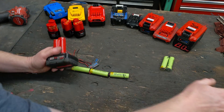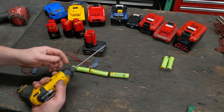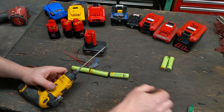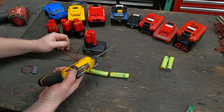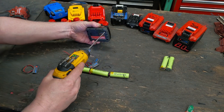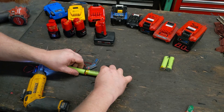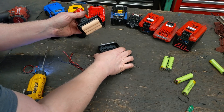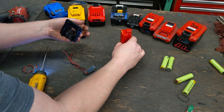All we have to do is take this apart and start wiring it up. We do need one thing — almost all these battery packs use a Torx screw. This one's a T10, though some use a T15. It's a Security Torx, which just has a little dimple in the middle. These are cheap — I'll put a link below where you can pick them up on Amazon. We get all four screws out and the bottom just pops off. The sticker kind of holds it but the top even pops out and you're ready to move along.